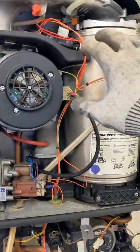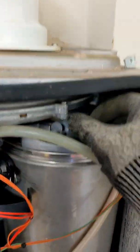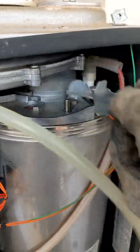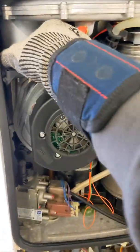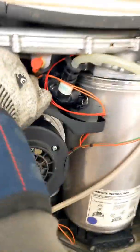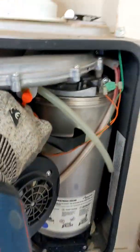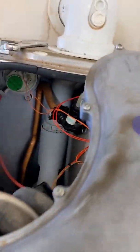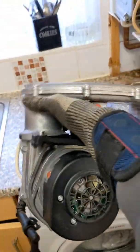I'm going to take this out and then we can tackle the hydraulics afterwards. Gas connections are undone. There's a 13mm nut up here. Now depending on what year it is, you'll either have the little retaining nut or you have this plate that holds the top in. Once that's all done, you just grab the fan, spin it. That spins forward — make sure the grooves line up there and then it will just lift out. Fan assembly is up.